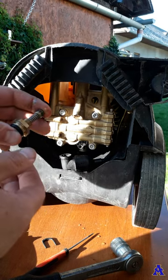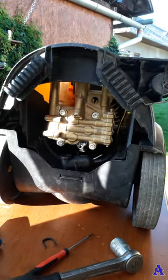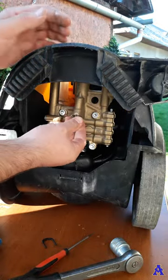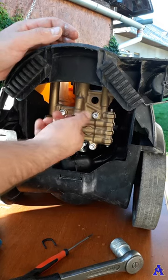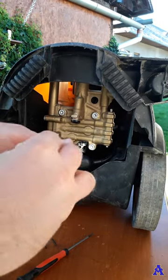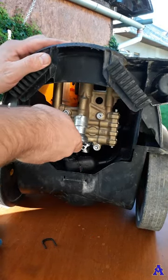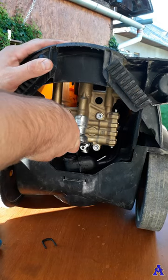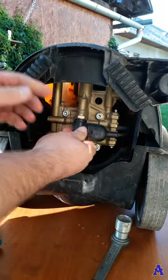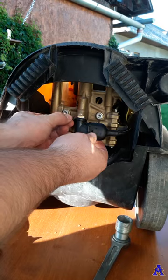Unfortunately, right now you can order only the whole thing, whole control piston set, and whenever you have a new one, all what you have to do, just use a silicone grease, grease all the O-rings, and you can tighten it like this. And with the reversible ratchet, use reasonable force, don't overdo it, don't damage the thread, please. I got it. And now you can connect this part and the plastic U-pin. Like this.